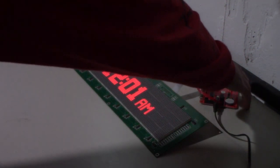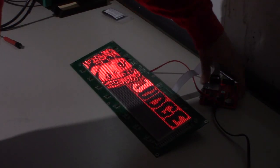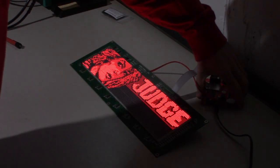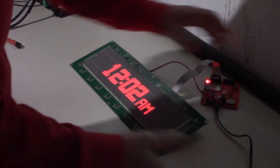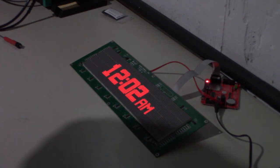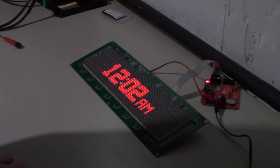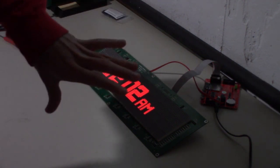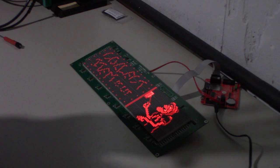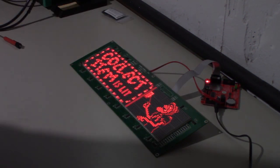Just make sure if it boots up and you don't see anything and the LED's flashing, hold down button 3 and plug it in. And then it'll boot you into that mode where it cycles through all your display options, and you're going to pick pinball LED, at least if you're doing it with a Stern DMD. So I'm going to go ahead and unhook everything, and then we can figure out how to get it mounted on the acrylic, and that's the last thing that we have to do.